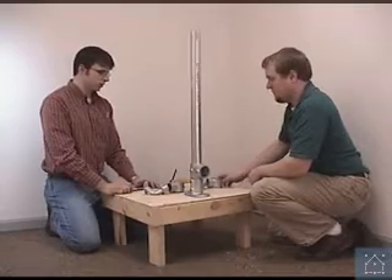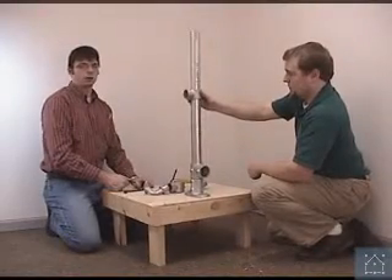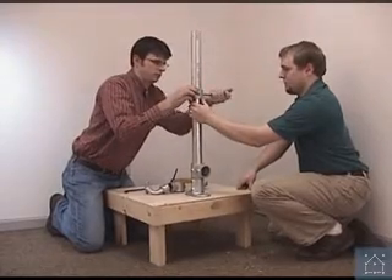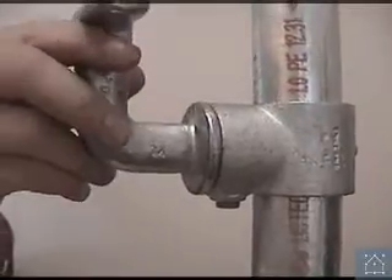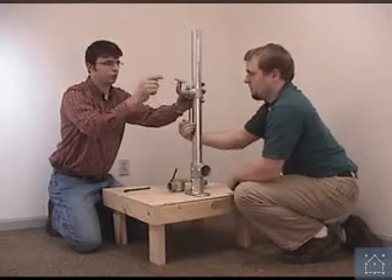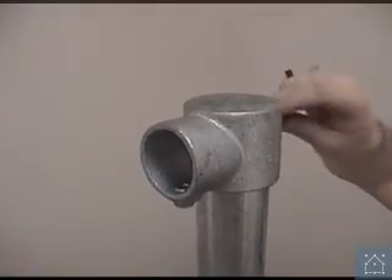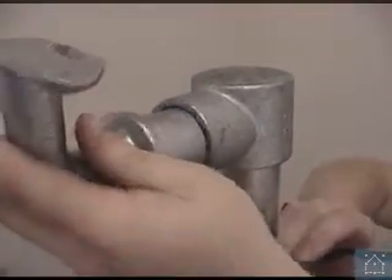The next piece in this particular railing is going to be our mid rail. We've already marked the spot on the post where this mid rail is going to come down to, so we're going to go ahead and tighten this on to the post. We showed you these little fittings before — this has a variable angle, so we'll need to play with that angle a bit once we actually put the railing on. For now we're just going to tighten it down a little bit so it doesn't fall out. And we're going to put the top piece on. We have several types of top rails available — this is just the style we've chosen for this demonstration.